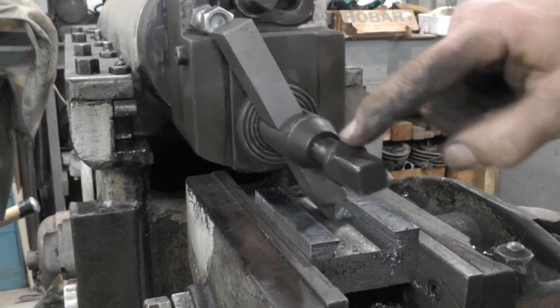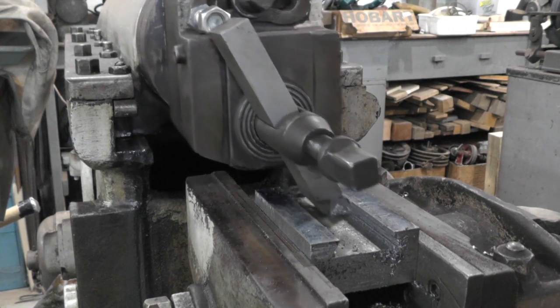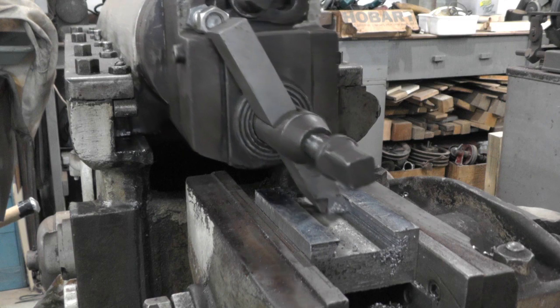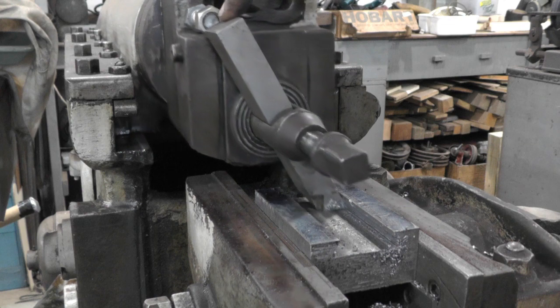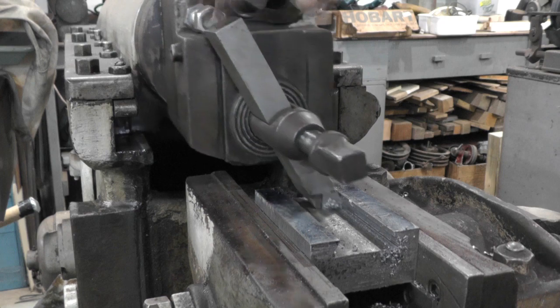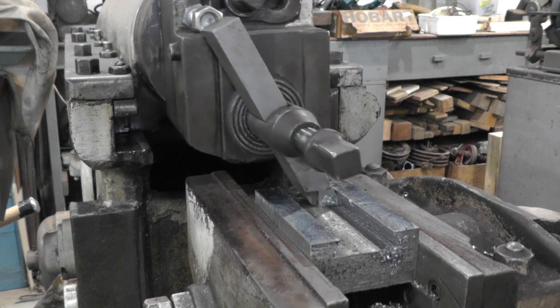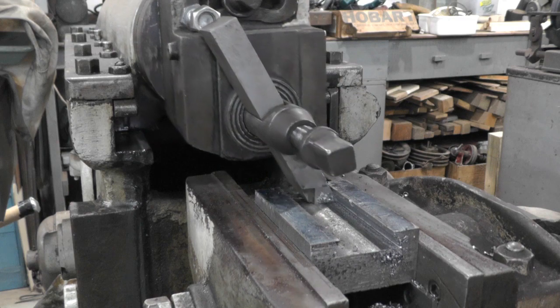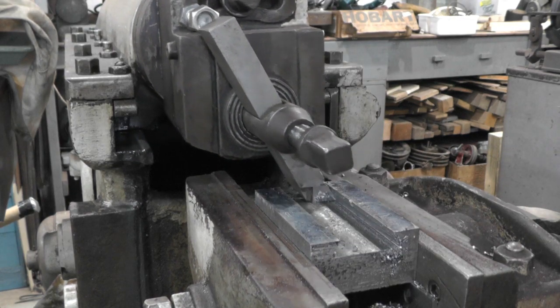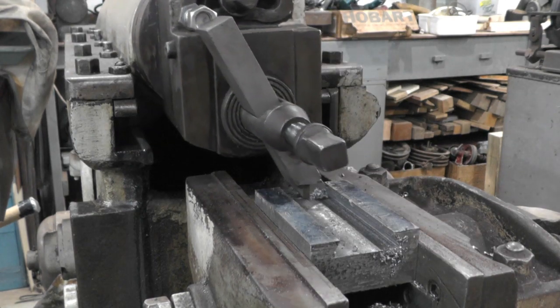Snag. The clapper box started clapping when I started making heavier cuts, and it was causing some issues, so I wound up taking a half inch bolt and putting it between the actual cutter and the stationary part of the ram, and that stopped it from moving at all. Now I'm getting some better cuts. I'm getting near the end of her, I think. Been a challenging project, at least for me.